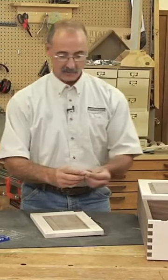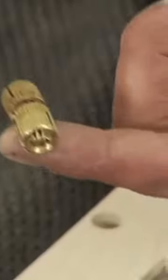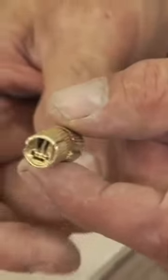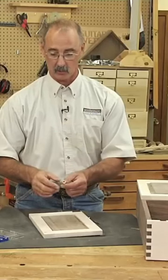Let's have a look at one so you know what I mean. This is a barrel hinge. They're available in different sizes and they're metric. So this is a 12 millimeter — that indicates the diameter here. When they're called out as metric, you have got to drill a metric hole.